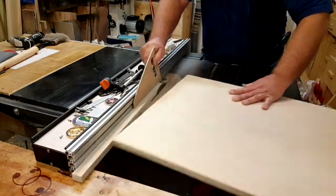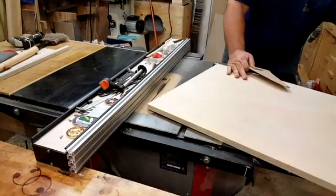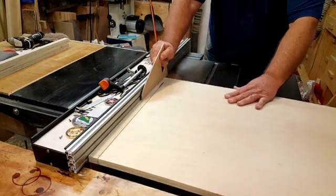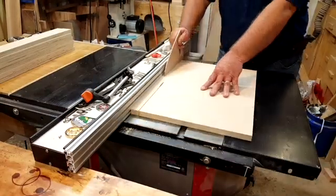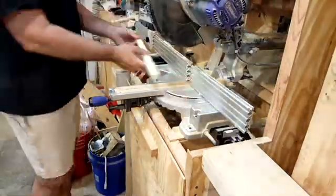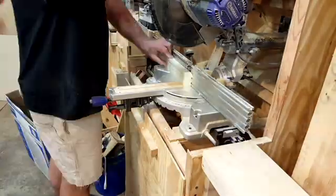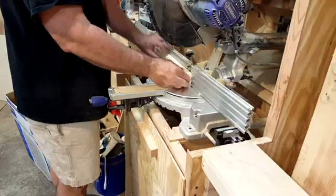Now it's time to cut out the 1-inch spacer strips that we use to separate the filters and create a slot for the filters to go into. It'll also create a cavity for the fan to slide in. There will be 6 filter strips for each panel. The filter strips now get cut to length. Even after stacking these for one cut, it sure was a lot of cutting.